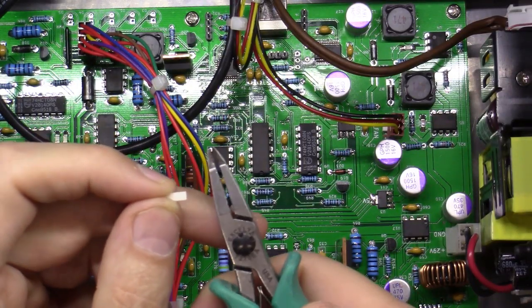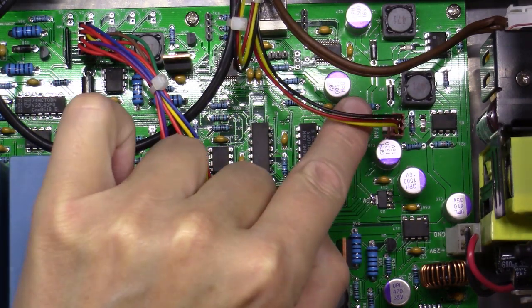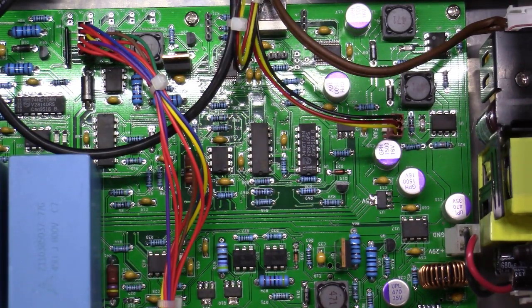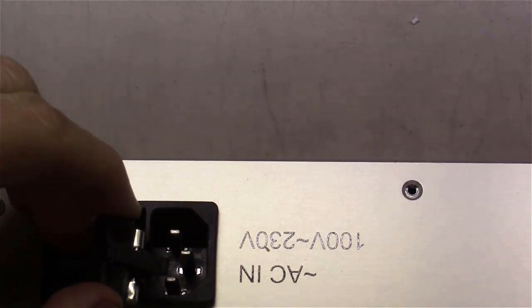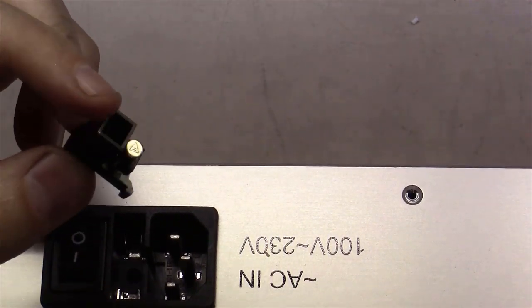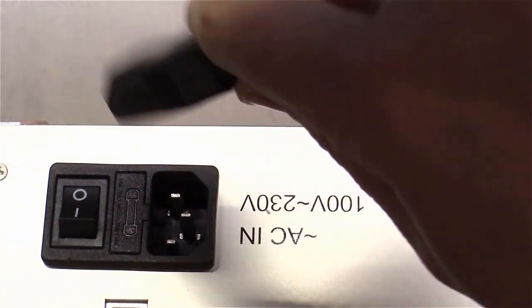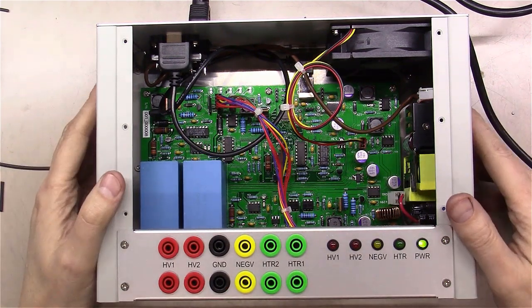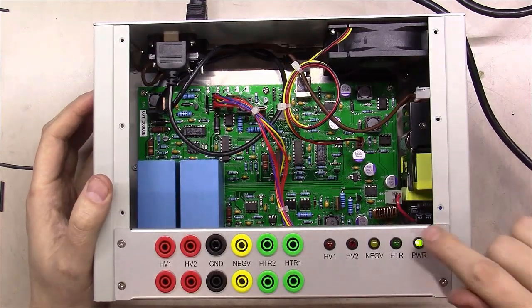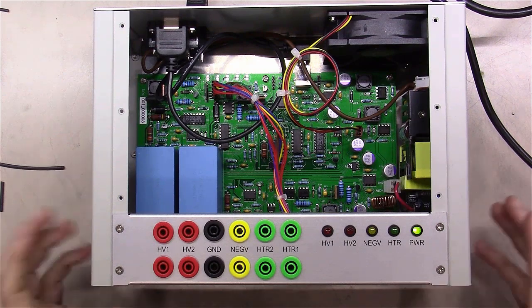You'll need to go in the back of the unit and insert the two-amp fuse — there's also a holder for a spare fuse inside. The unit doesn't come with a fuse, so you have to get that yourself. Plug in a normal IEC power cord, and — we have a super quiet fan running and a power indicator LED on. That tells me the unit is working, and furthermore there is no smoke coming out of this unit.